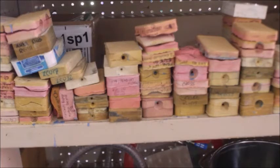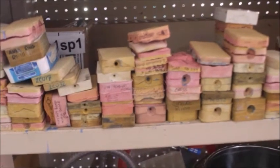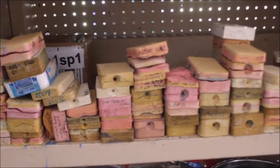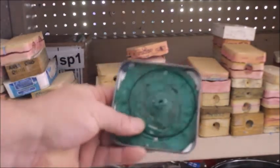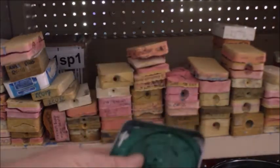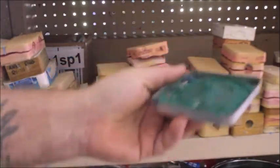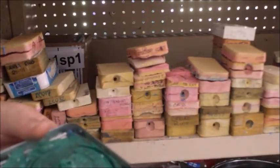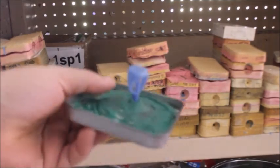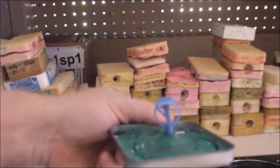To do the casting, you're going to have to get some investment powder. It's just like plaster of Paris, but you have to buy jewelry casting investment powder specifically. I've got videos on every subject. Then you get a can lid like this — just a little metal lid — and you put some plain old modeling clay on there. That's your sprue base. Then you put your wax pattern on it just like that.